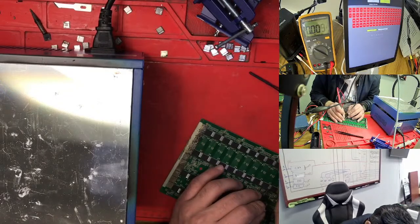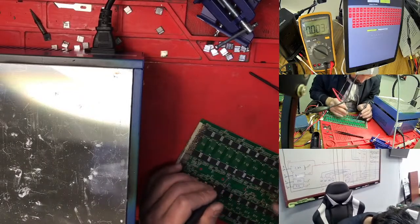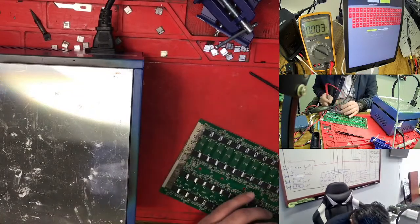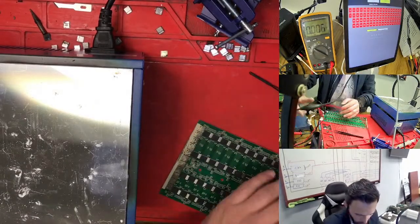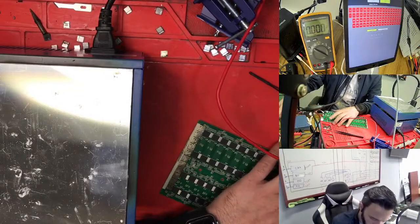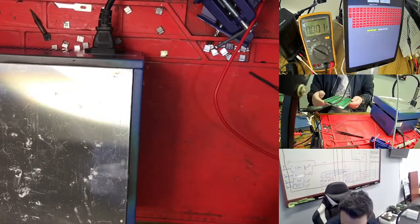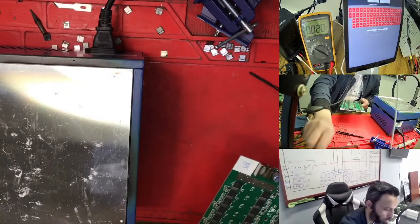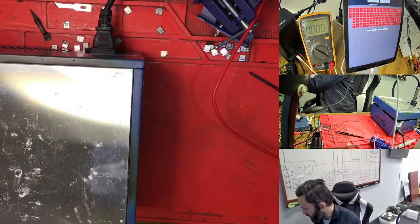If I go here with the pin, nothing. So suppose the problem is somewhere from here. Okay, we go this side. We just need to follow here, nothing. So what is chip number one? Anytime you see the board heat up very quickly, you cannot test. You need to wait to cool the hashboard again, and after that you test again. But because we put the 12, it's not enough for power, so it's not turning on. Anytime it's on quickly, you can test. So I'm putting this one aside to cool down again.